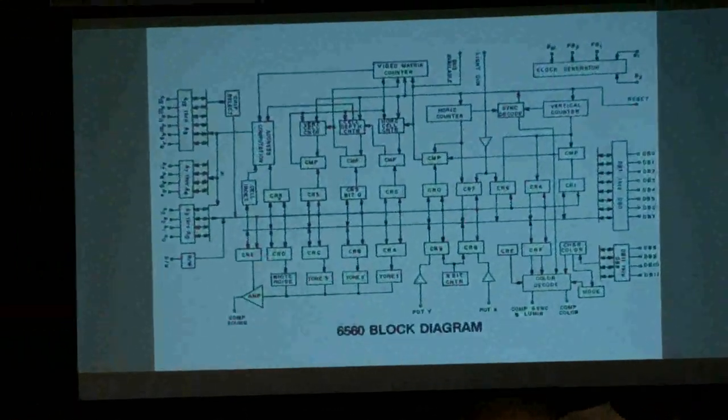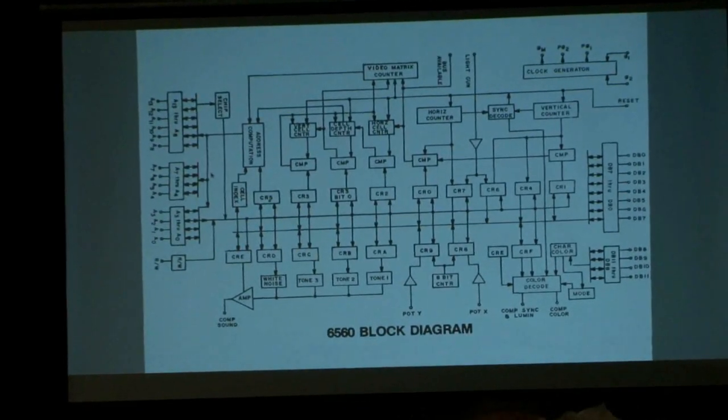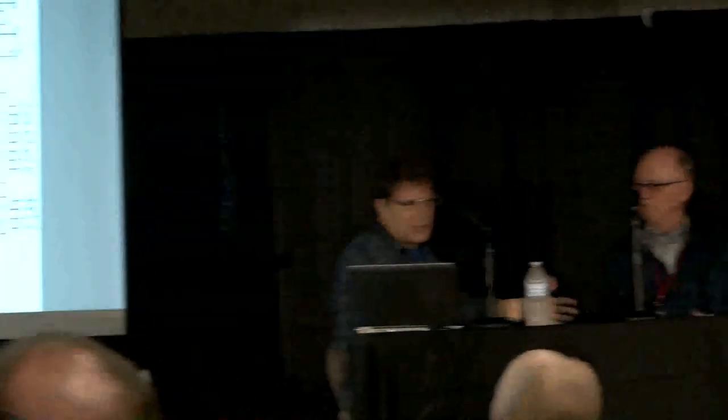So my understanding is that for character graphics like this, it's mostly about horizontal and vertical counters and address generators and things like that. Just looking at that, that's vaguely what's going on here. You've got a bunch of registers controlling the size and the rest. Correct. Looking at a TV screen as a digital structure, you just have so many pixels across and down, and you have to create the vertical blanking and horizontal blanking periods.